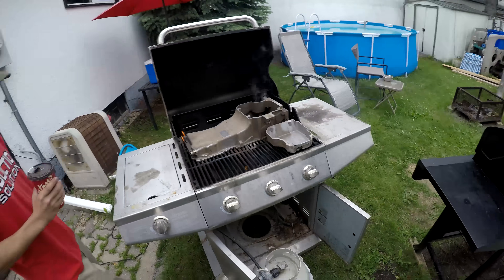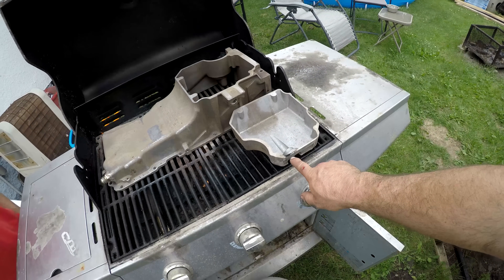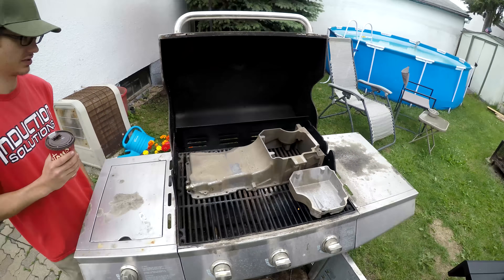We're heating this one in the old barbecue. You can see there's oil coming out of the porous areas. There was some coming out but it's kind of stopped now. Hopefully this pan isn't as bad as the one on my truck. We're going to hopefully get her welded up, get it back on the engine, and get the engine in the car.